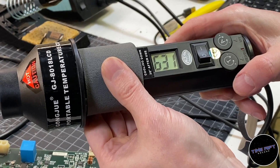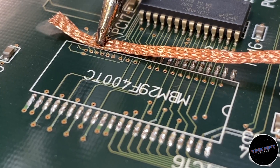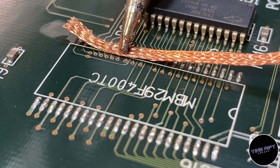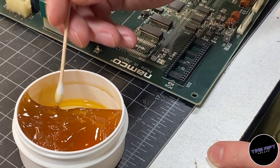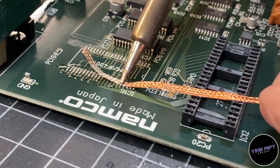Then I'll set the heat gun to cool mode and let it run for a few minutes so it will cool itself down. Now it's time to use some solder wick — or desoldering braid, whatever your preferred term is — and clean up the old solder on these pads. My first attempt isn't working so great, so I'll grab a little flux and spread it over the area. This just makes a world of difference; the solder is gobbled up easily.